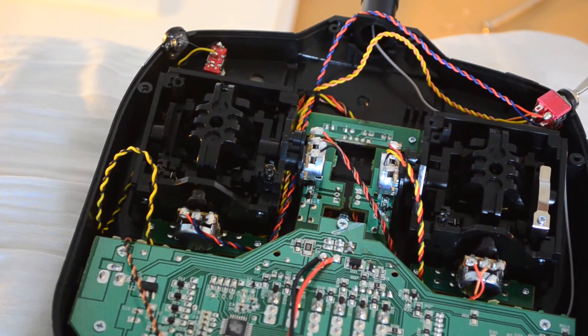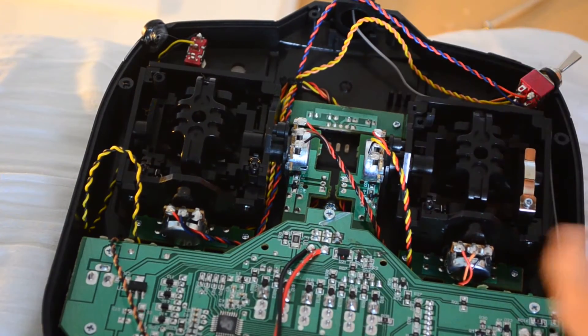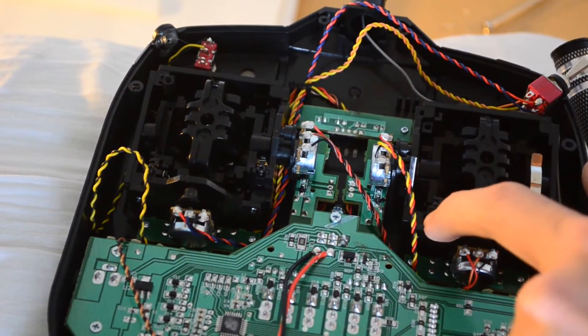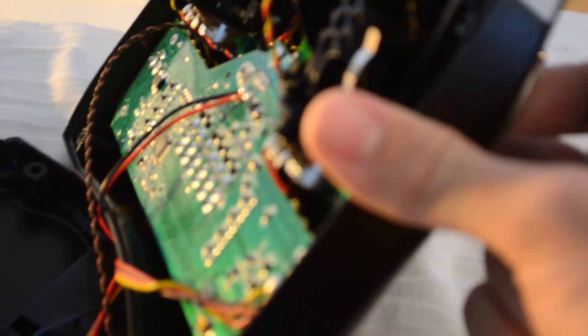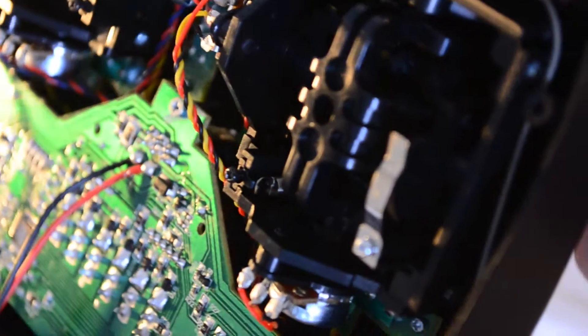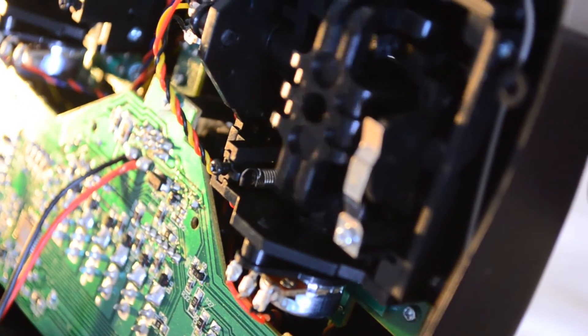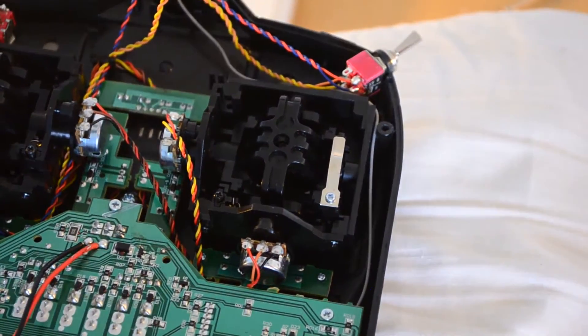If we look, you can see the gimbal is more covered. The horizontal and vertical axes for the gimbals are actually separate on this one, whereas on the DX6i the vertical axis was contained inside of the horizontal axis. On this one they're actually independent — if you move the horizontal axis, the vertical axis doesn't move, and vice versa. So this is definitely a very different gimbal from the DX6i. It's not as smooth of a gimbal, but we're going to adjust it and try to make it a little bit smoother. The gimbal on the DX6i is a little bit higher quality, so you're going to have to be more careful adjusting this one — it's all plastic, there's no metal in it.